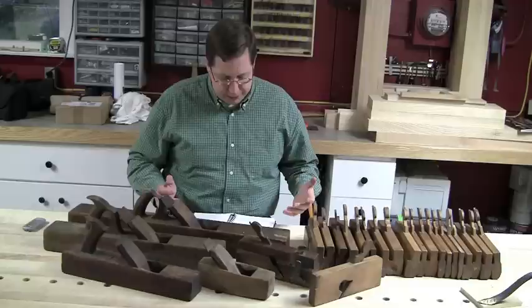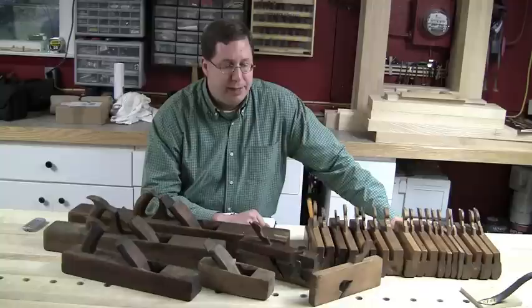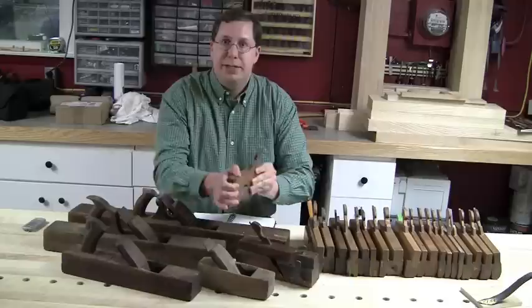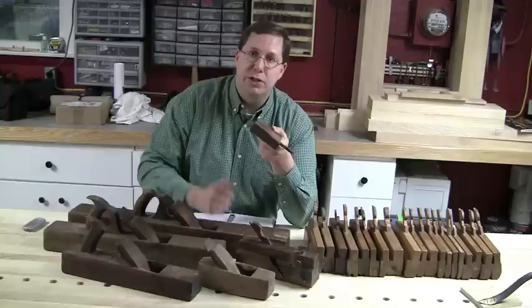Adam also talked about making a drawer blade dado — the dado that attaches drawer dividers and drawer blades — and making a groove for the back panel. He noted that period cabinet makers were all about getting things done quickly. A shoulder plane could be kind of slow, continually taking passes at maybe a 16th or 32nd of an inch shaving at a time. So Adam showed the technique to quickly remove that waste using a chisel first and then come back over it with a plow plane or shoulder plane to clean it up.